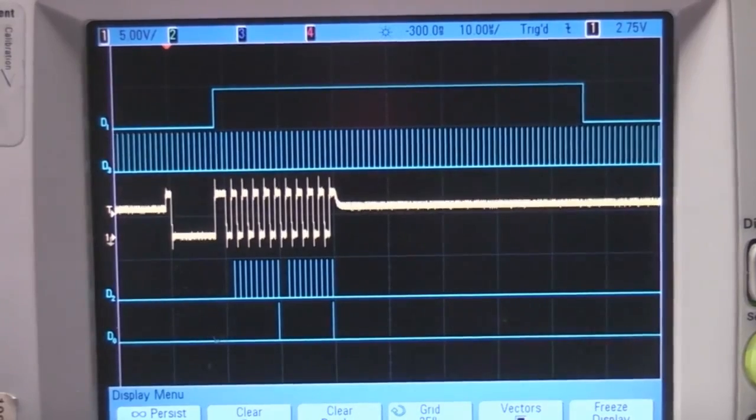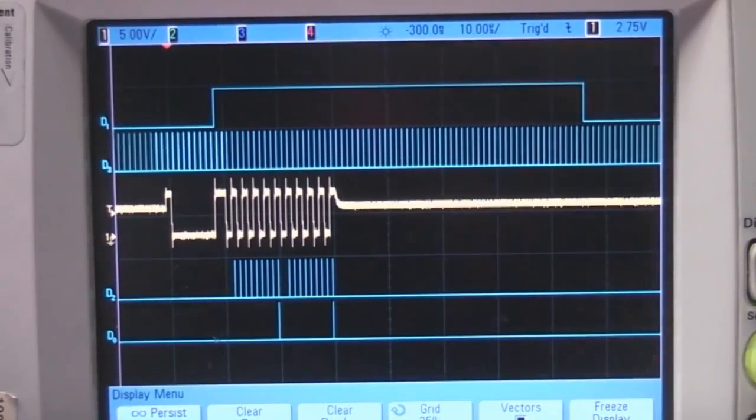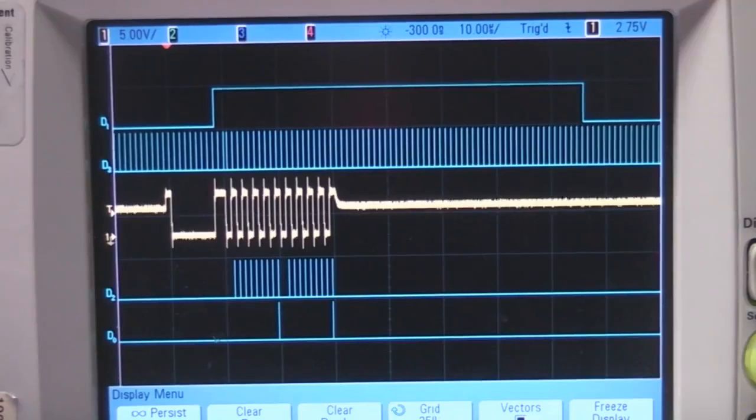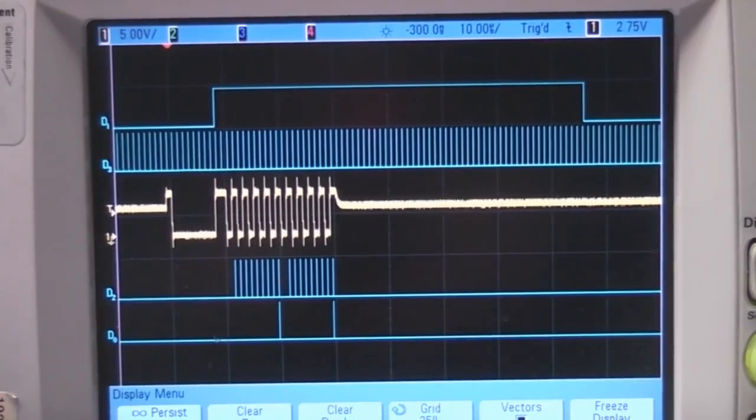One of the things I like about the MachXO2 is that it's got an internal oscillator. Unfortunately it's only guaranteed to be about 5% accurate, which isn't really enough for doing UART comms, and obviously getting data into this thing, UART's going to be by far the easiest thing. But of course one nice thing about being in an FPGA is you can roll your own custom UART to work around problems like this.